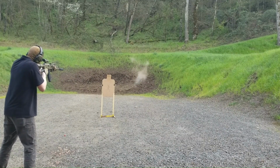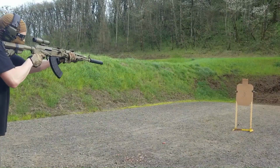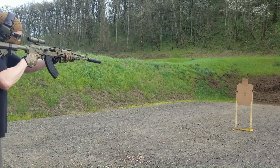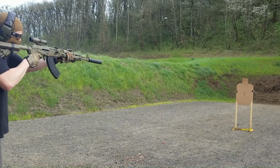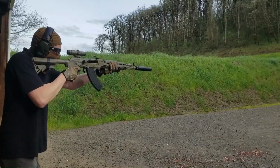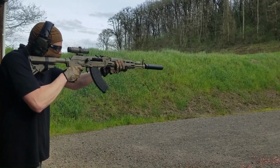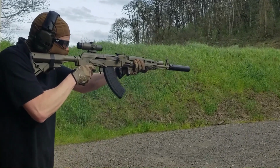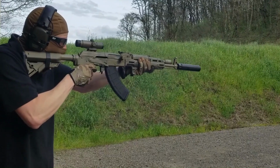In conclusion, my muzzle threads were clearly not concentric with the bore. I should have taken a closer look at the muzzle and measured the wall thickness in a few spots before doing this work, and I honestly don't know why I didn't, but hey, sometimes we all miss something. However, I got very lucky. By cutting a slight angle on the muzzle face, I was able to pull the muzzle device into alignment with the bore due to the play in the threads.